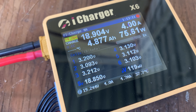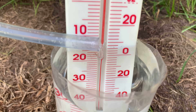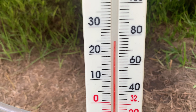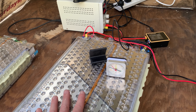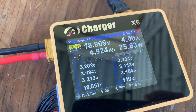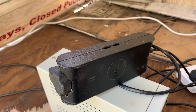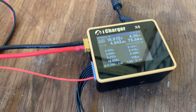I just couldn't give up on it — turned it all back on again. As you saw, the battery got a little bit hot. We've got a garden hose in and out of the battery, pouring it out into a thermometer just to monitor the temperature coming out. That water's not even warm now — I think the actual temperature was coming from the initial charge getting over that resistance in the battery, but now it seems perfectly cool. We're seven hours in, charging at 4 amps there and 3.5 amps there. The Dell power brick off the laptop running the iCharger keeps overheating — which is ironic. Everything's overheating.